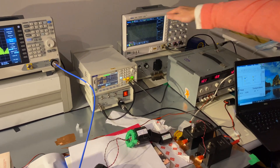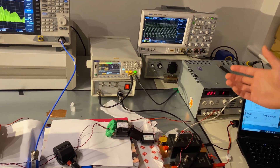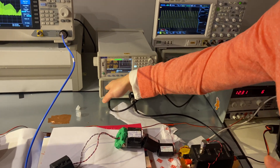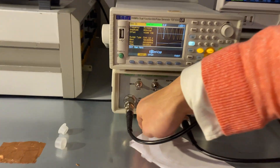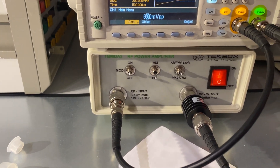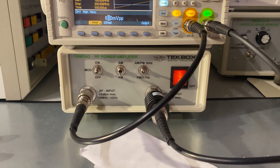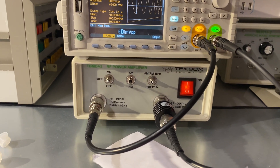The oscilloscope in this case is just to monitor the input to your RF amplifier, making sure that what you feed to the RF amplifier does not exceed the rated power of 3 dBm maximum. I set the peak-to-peak voltage to 600 mV to make sure the RF input of the unit is well protected.